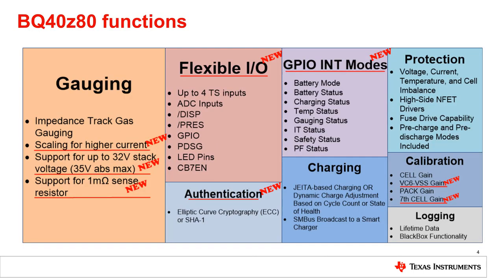This chart shows all the new features built on top of the BQ40Z50 base functionality. Because the BQ40Z80 is scaled up to 7S, it naturally makes sense that high current packs will also be developed with this part. The device can natively support pack capacities up to 29 amp-hour and battery currents up to 32 amps. With current scaling, the scale factor can be set between 0 and 100 with the scaled current still in 1 milliamp resolution. To reduce losses in the sense resistor, a 1 milliohm typical sense resistor is supported, but this can be smaller if larger currents are used.